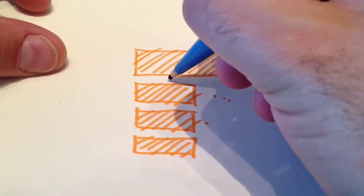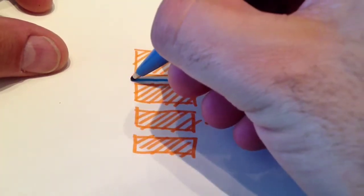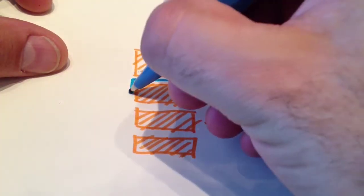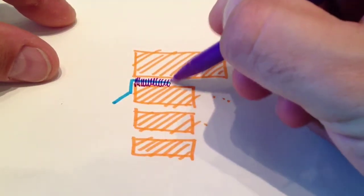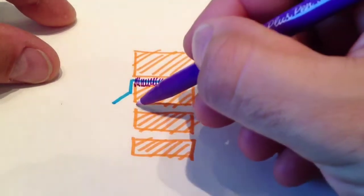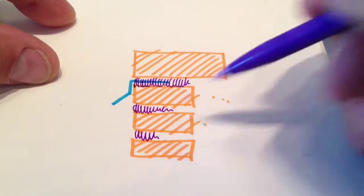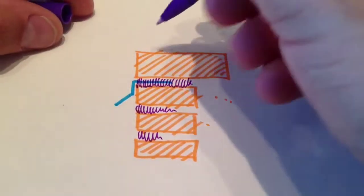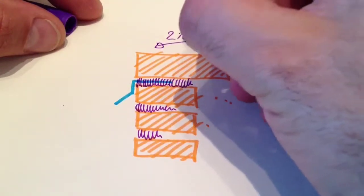And what we've now seen, assuming what's going on inside the wall, is that there should be a flange over here, then it runs down and something like that. That's a steel profile that's hidden within the mortar layer over here. That gets a good connection, so there's also mortar layers over here and mortar here. And what we actually see is that there's a slope over here, presumably 2%.